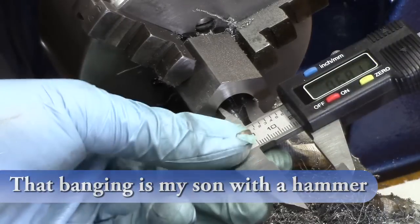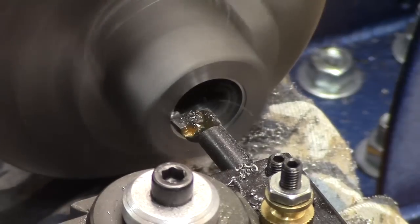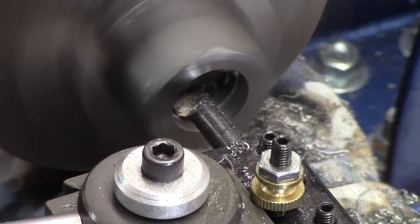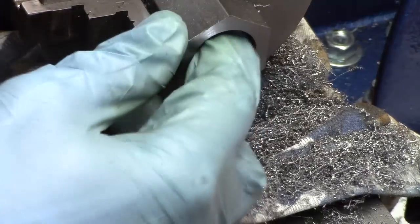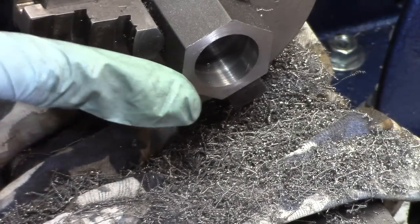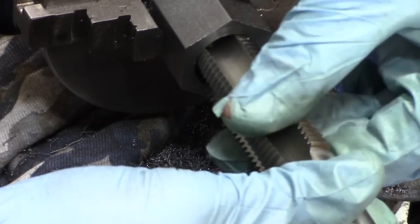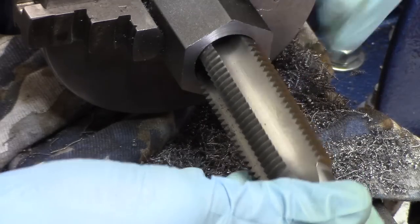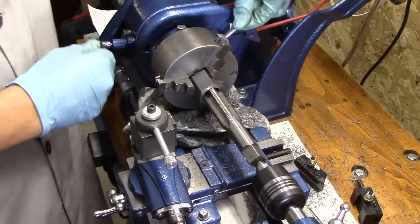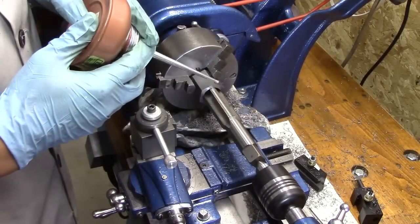Time to measure — 682 thousandths, so I've got quite a bit more to go. The finish on this is incredible — I'm so unbelievably shocked that this is working. I think I've got it to the right size, or close. I'll start putting the tap in here and see if we can tap out this hole. I've put a live center in here to hopefully keep it centered up, and I'll put it in back gear to lock the spindle and cut some threads.